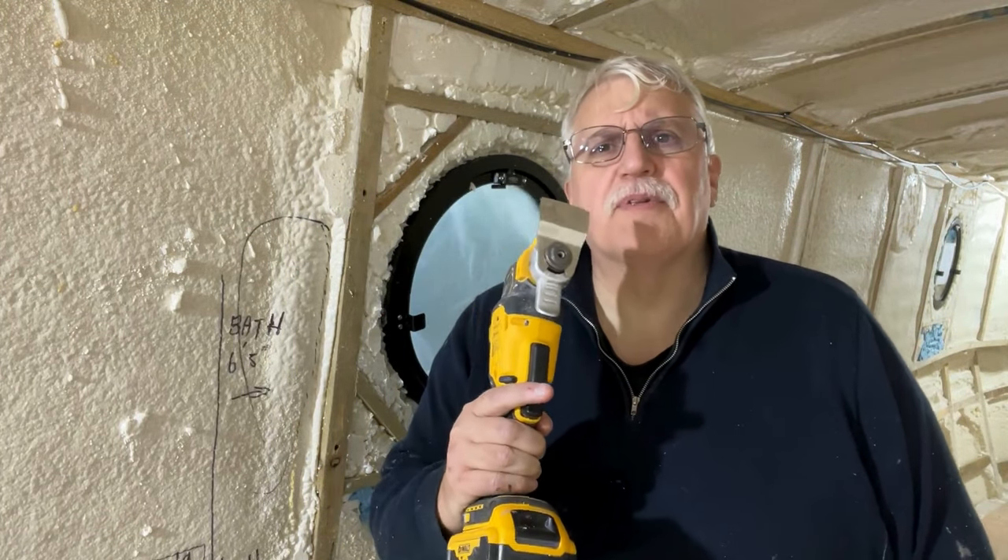The battening in this boat — I think the standard from the boat builder is a centre cable tray. That's the way they think, because when I look at how they put the battening up on the ceiling, it's definitely that way inclined. But I've found a way around that, so I'm quite happy. There's not going to be many ceiling cables — clearly the lights, but they're only two and a half mil, so they're tiny. The biggest cable going up there is a six mil solar cable, and there are four of them, but that's not going to present too much of an issue. Now that I know where all the cables are going, time to go and trim some spray foam.